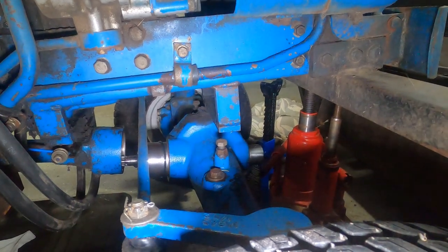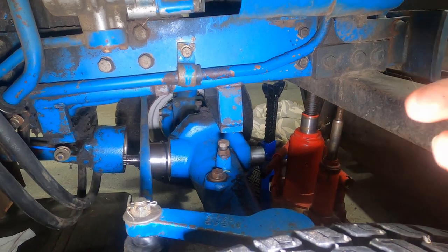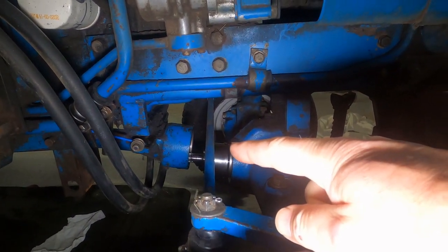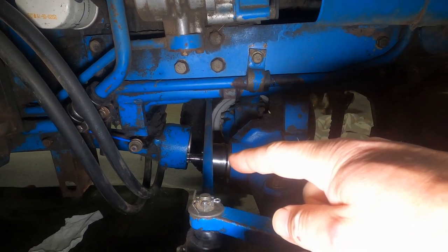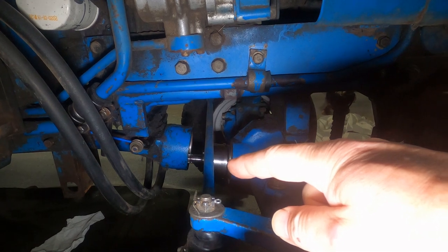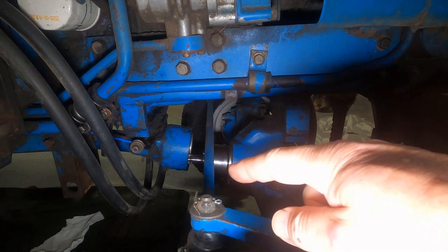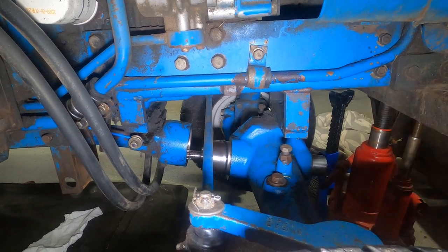Next, I'm going to get these tires off and disconnect the axle so I can drop it down a little bit and slide it sideways. I'll get that other bearing out. That was a bit of a nightmare. Hopefully the back's a bit better, but I effectively had to cut through the bearing just so I could slide it out. I couldn't even see the joint in the bearing halves. So this is how much pressure's been on the front - but I'll get started on that and I'll bring it back when that's done.